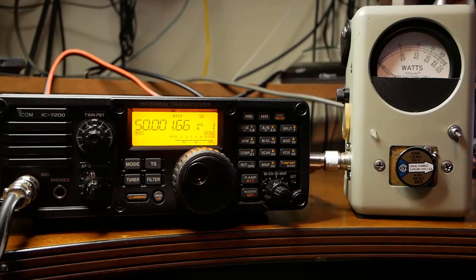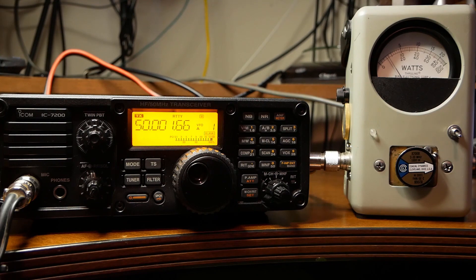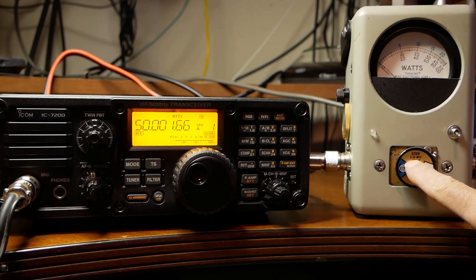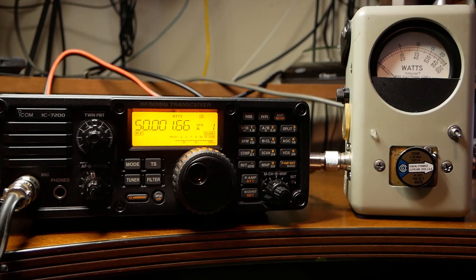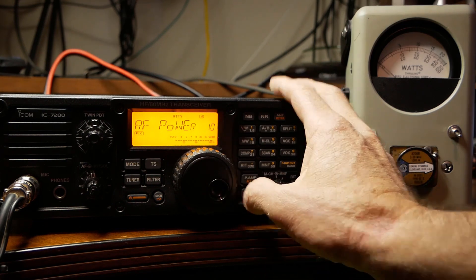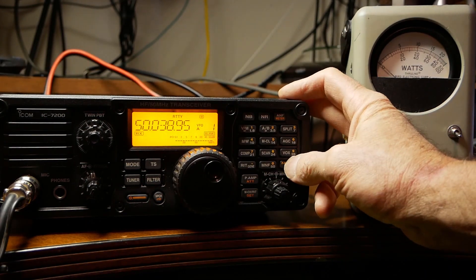I will post a picture of the layout of those diodes at the end of the video so you can see exactly which one is which. The transmit is now open from 100 kHz all the way straight through to 60 MHz. I just wanted to show you on the 6 meter band we have our full output according to the power output on the radio. Of course, I'm using a 2 to 30 slug so that's not going to register 100 watts on the bird meter. And I'm in a dummy load, so anybody that sees me transmitting out of band can... well, whatever.